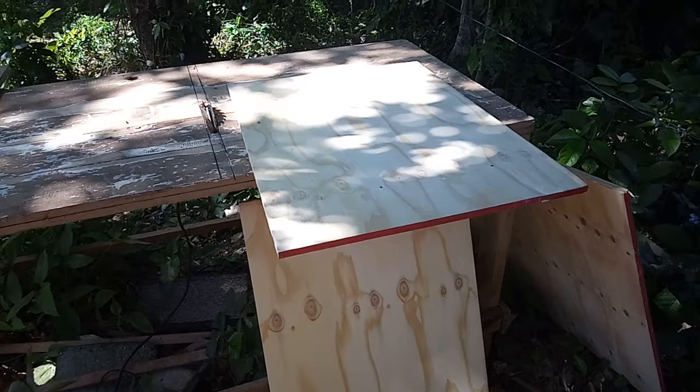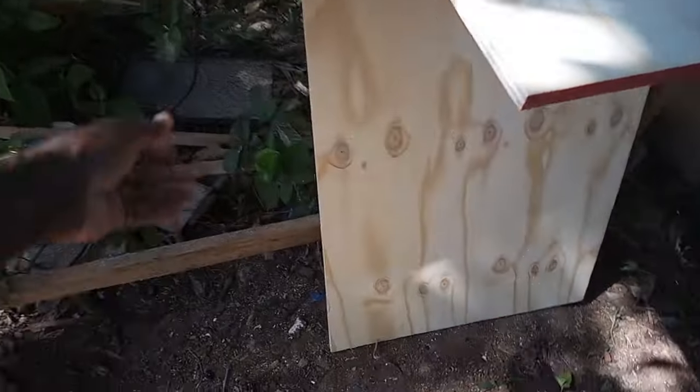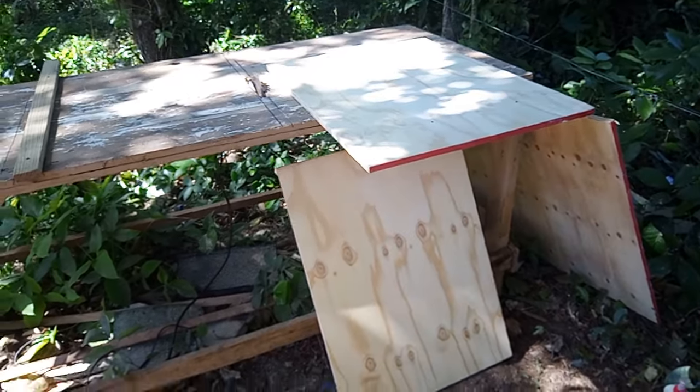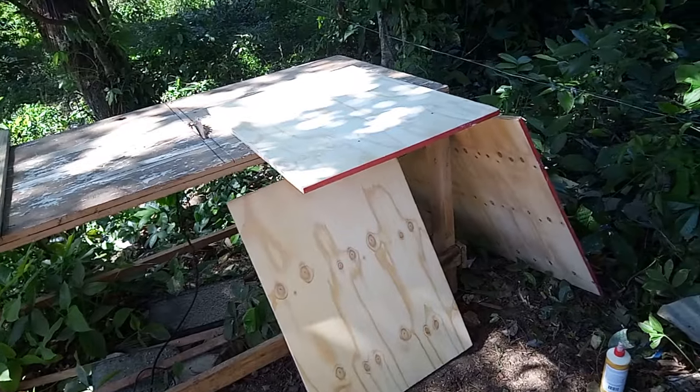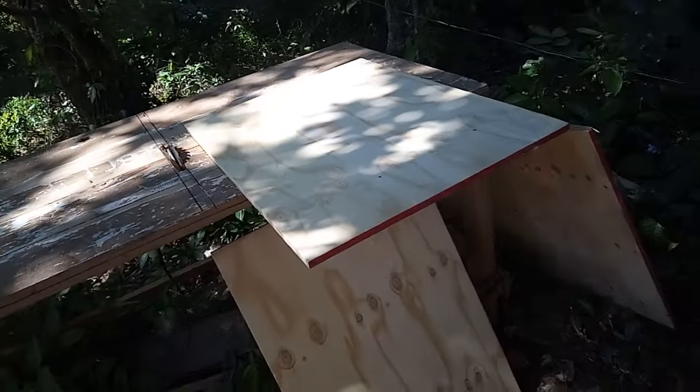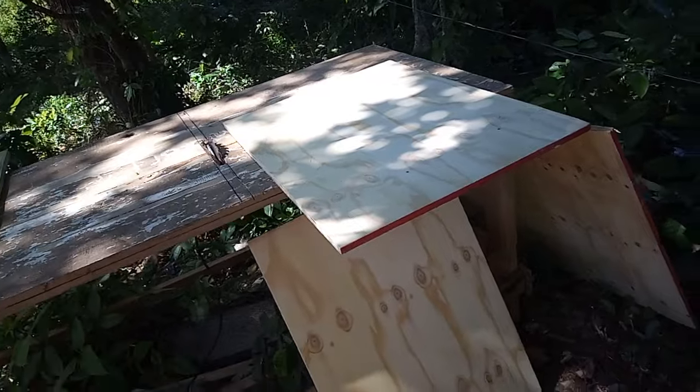Sorry about that, stick and stay. After cutting a while ago, I have one piece here, next piece here. I need four sides for one box. These two are the sides, these two are the back and the front, because the speaker is gonna be inside and you can't see it. In a fourth-order bandpass box the speaker is in the middle — there's a partition, one side sealed, one side ported where the magnet faces out.